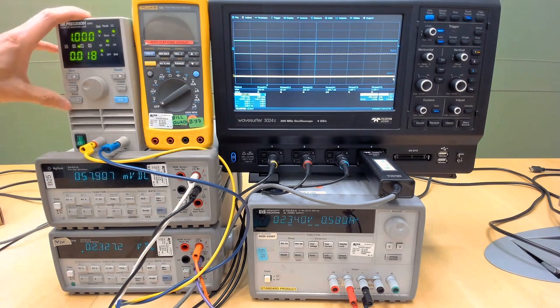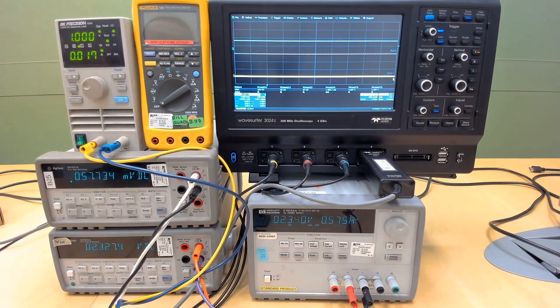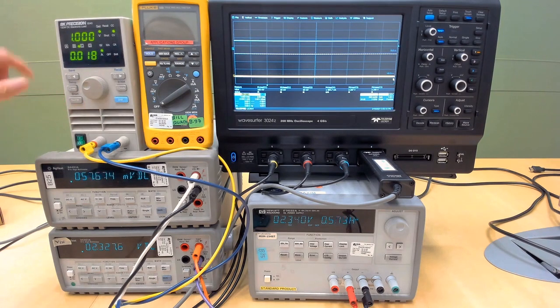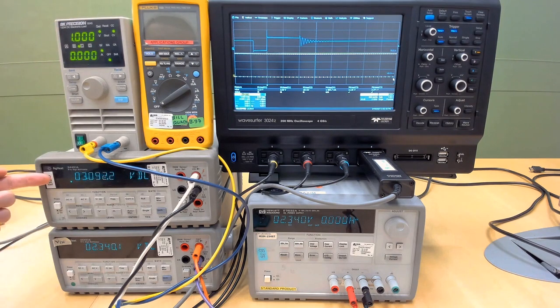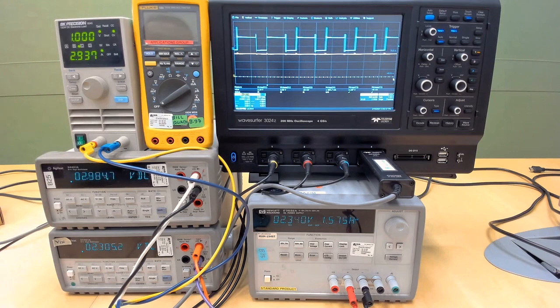This EV kit is not damaged. It is shorted now, but to show that it's not damaged, I am going to turn off the short. I will turn off the short and then turn off the electronic load, and the output goes back to 3 volts. We can then reload the converter with 1 amp. That demonstrates the short circuit protection feature.